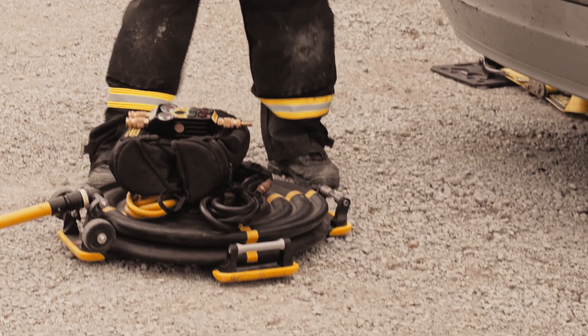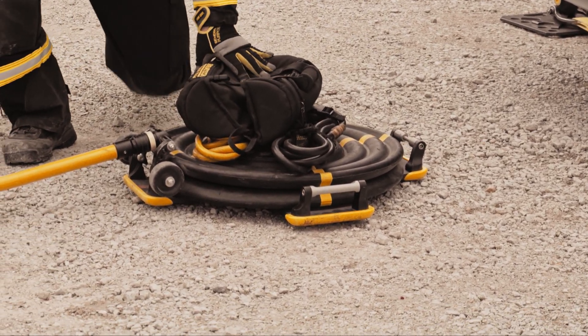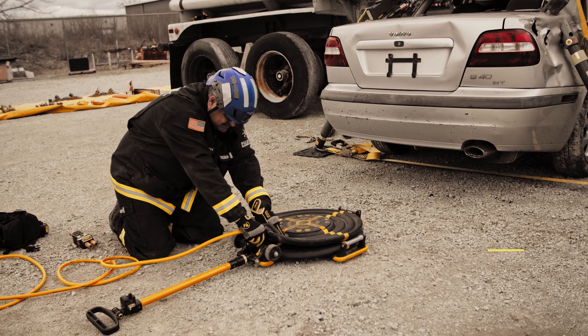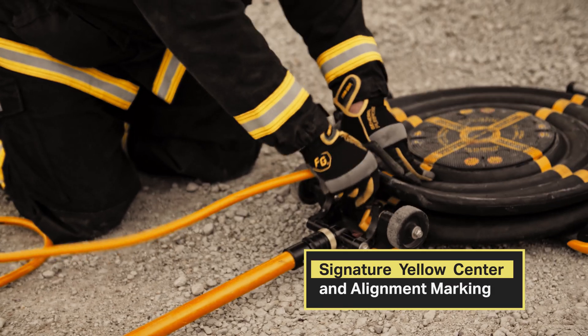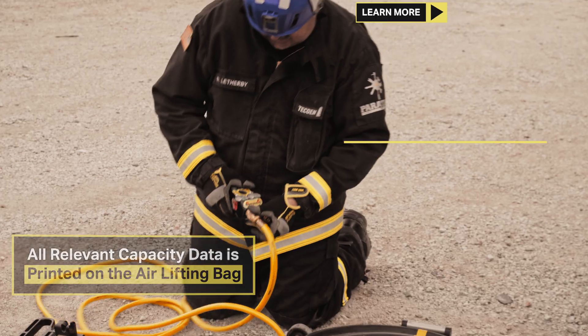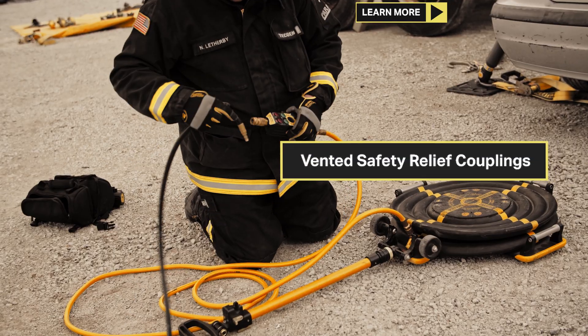Then we're going to set up for the Multiforce to do the lift on the car. For the person that's trapped, make sure the handle's down. Tighten up your safety collar, make sure it's on. Connect your hose to your controls, tighten up your safety collar, connect your air source.